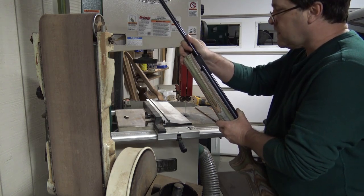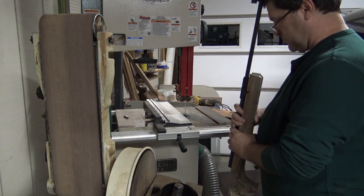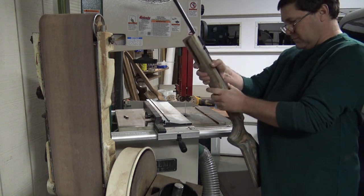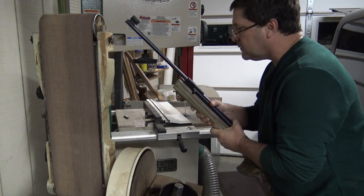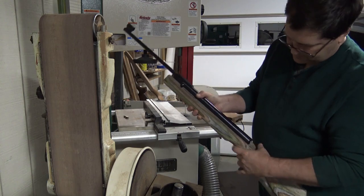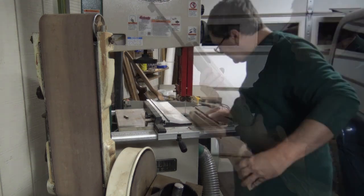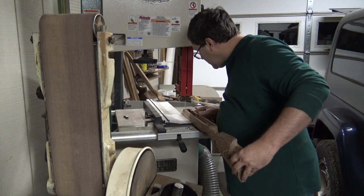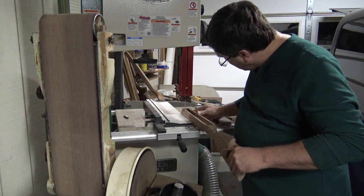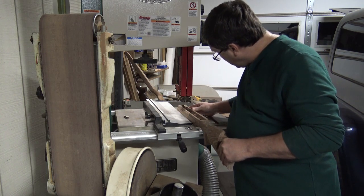Right here I'm just looking to see — I just bandsawed out the forks and I want to make sure they're spaced even from the reach block, the same on each side, everything running straight. I'll say later on that things get a little bit off talking about the receiver laying in there. It's not a lot — I probably only took off maybe 10 thousandths on one side to get the receiver to lay in straight.